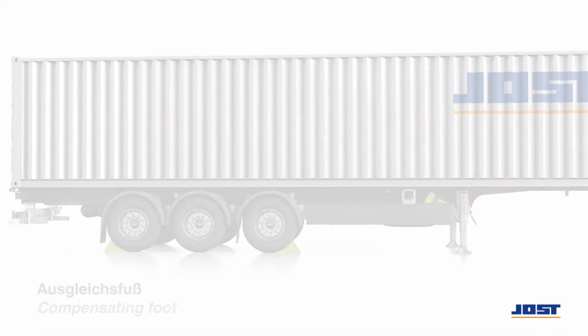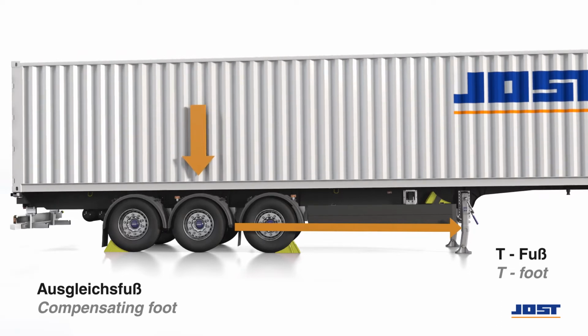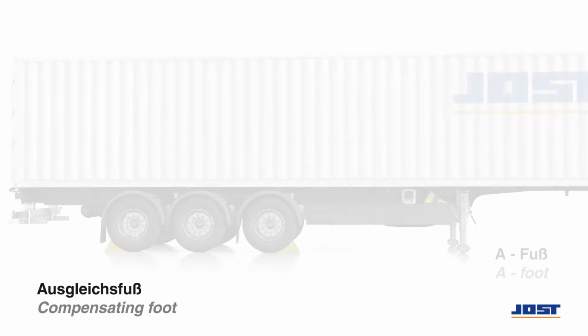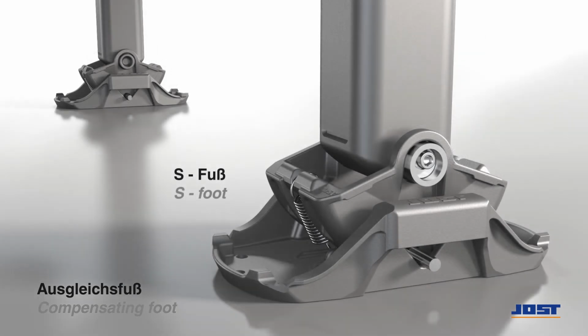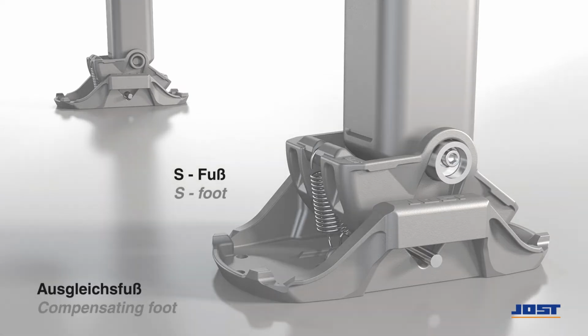With the trailer uncoupled, leakage over prolonged downtimes may lead to unintended bleeding of the pneumatic suspension, resulting in the rear of the trailer lowering. In the worst case, this results in overstress of the landing gear. On solid ground, the A foot is able to follow the drift to prevent the landing gear from bending. The S foot is an advanced version of the A foot and doesn't sink in, even on soft ground.